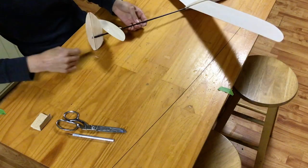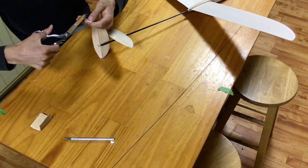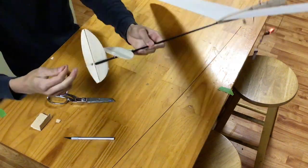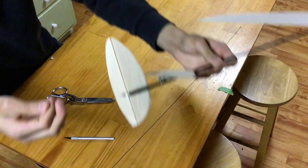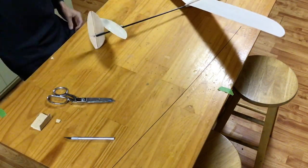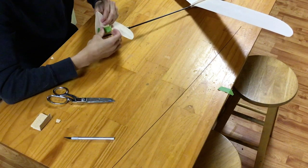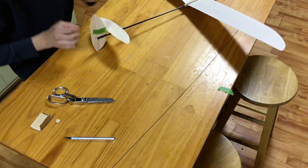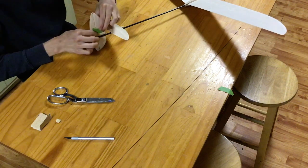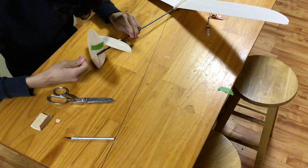You'll now go to the aft end of the pull cable, and you'll cut off that limiter that you put on earlier. Then, you'll take the end of the thread, and you'll wrap it around the control horn twice, similarly to how you wrapped it around the servo arm twice. Using a sizable piece of masking tape, you'll then tape the rudder in place such that it's deflected, pushing against the spring. In my case, that constitutes right deflection, but if you've put your rudder on the right side of your tail boom, that would be left deflection.